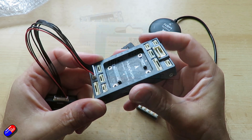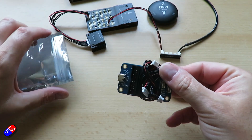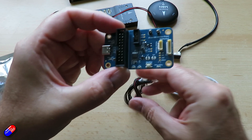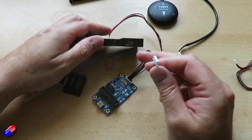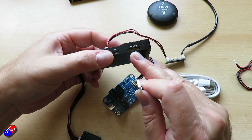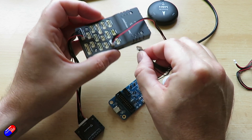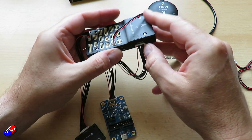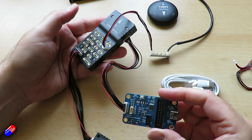Finally, for those of you that like to tinker, there's a new Pixhawk debug tool. This is really for advanced users — I'm probably never going to use this — but if you want to plug it into the debug port, that thing at the side you always wondered what it was for, it does allow you to do things like add a new bootloader or firmware to a completely empty board, and potentially with extra bits of hardware, debug the code and the controller on it.